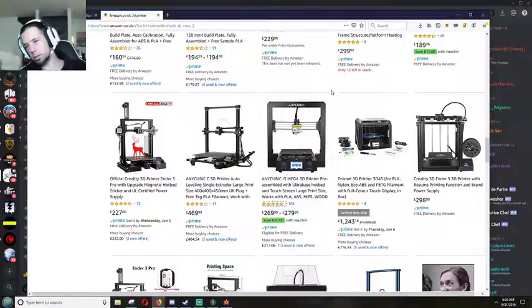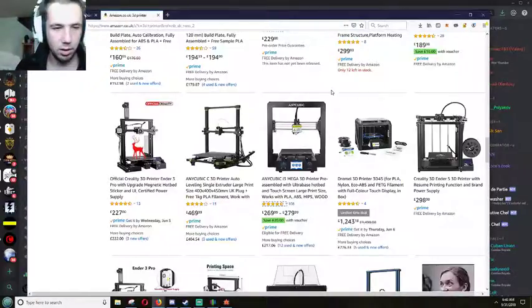See, the big problem with two nozzles is the second nozzle has to be completely level, and leveling it can be a pain in the ass. And then two, if one nozzle clogs and the other one doesn't, pain in the ass. When you're doing dual prints, there's ooze. If a nozzle is not going, then plastic for a little bit will melt out, and that'll get on your print, and then you've got to clean it up, or you've got a little bit of red where it's supposed to be white, shit like that. So all that can be annoying.